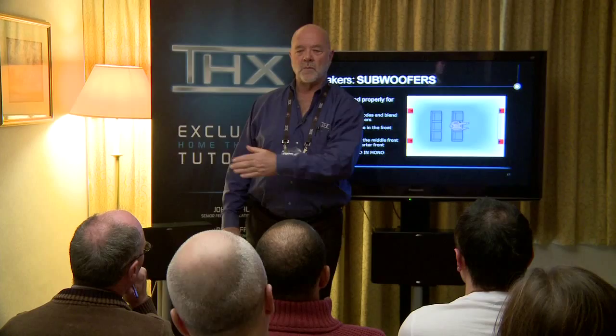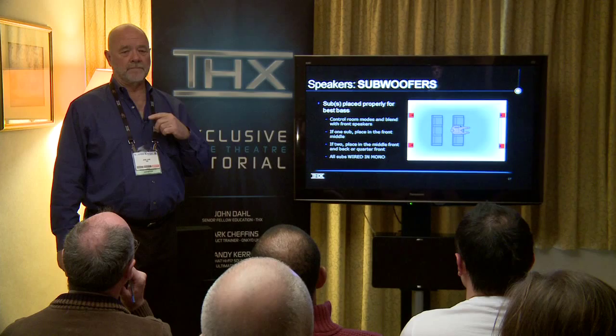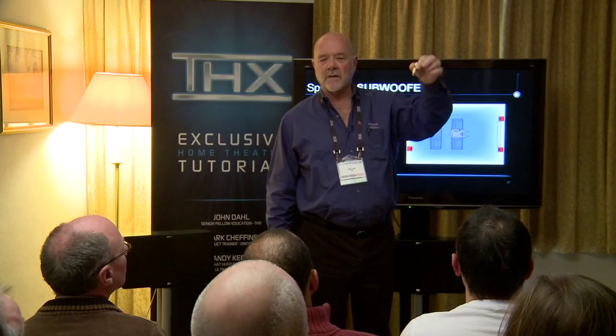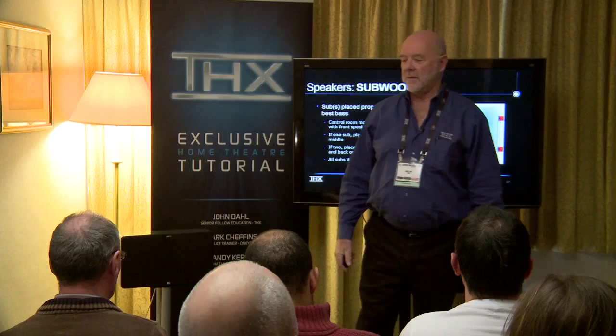Here's another really important thing: take the bass from all of the channels — below 80 hertz, every single channel gets crossed over at 80 hertz and all of that sound is sent to the subwoofer. The LFE track is mixed with that, and it all comes out of the subwoofer in mono. You can daisy chain subwoofers through the room using a simple Y connector and run that signal to all the subwoofers. Under no circumstances should you run a different signal to different subwoofers, as that defeats the purpose of smoothing out the bass with multiple subwoofers.